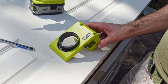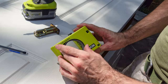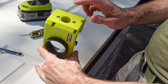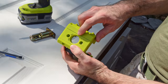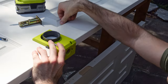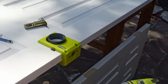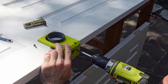Now I need to cut the hole for the deadbolt to go into, and the hole for the handle on normal doors. In my case I won't have a handle - this is just for the deadbolt assembly. I have a simple Ryobi jig that lets you cut both holes: the big hole for the assembly and the hole on the end for the latch. I line up the two holes with the pencil marks I made and attach the jig using the screws that come with the deadbolt to hold the latch in the door.